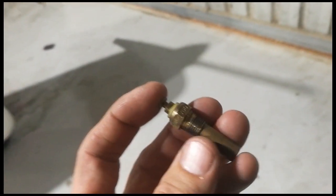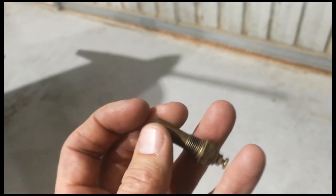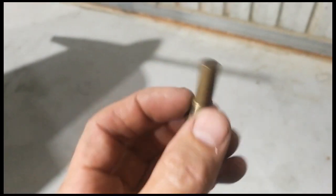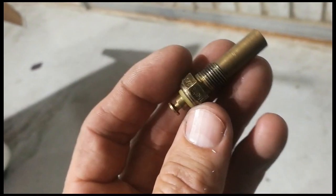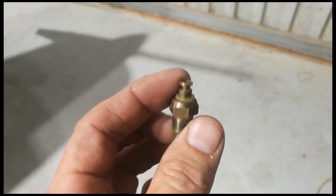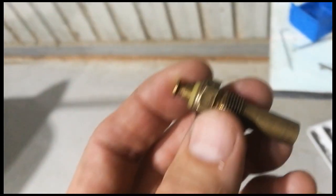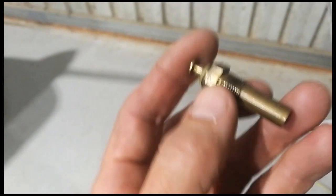So I thought this morning I'd pull the cowls off and do the same for the oil temperature. And lo and behold, I found that this sender is reading 13 degrees too high, which you often find. I normally check them because 10 or 15 degrees either side can be enough to drive certain individuals over the wall. I've got plenty of these in stock — we carry our own gauges — so I put my own ones in boiling water and it's measuring pretty much right on 100 degrees. I'm happy with that, so I've changed that over. That's going to save me a good 13 degrees Celsius. Not that I was concerned anyway — I could tell yesterday the engine was very happy and the oil temperatures were still okay — but this will give us a better indication now.